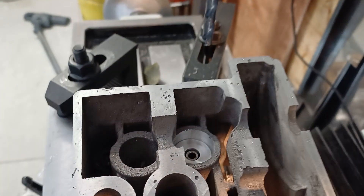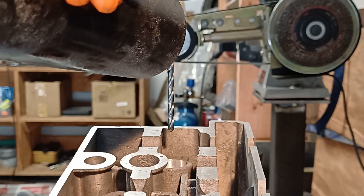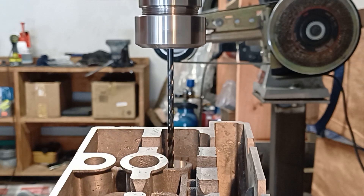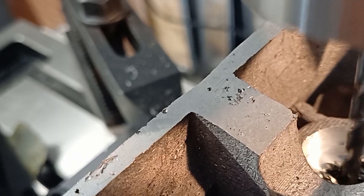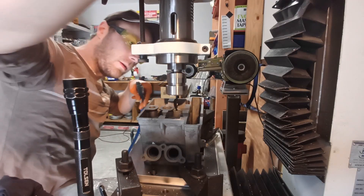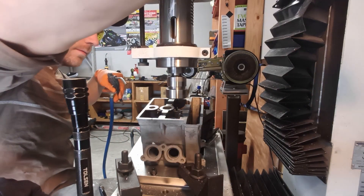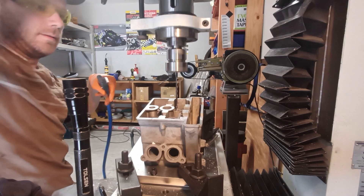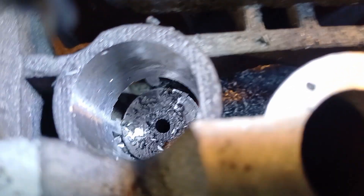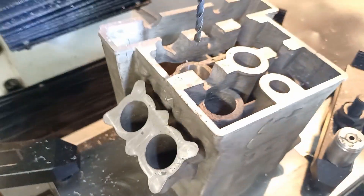Collet chuck with our new long drill bit in position, I'm going to chuck this down here, push that in, and now I'm going to see if I can drill the hole. I have a feeling that might happen. It comes through. I have the guide plug out and it seemed to do its job. We have a hole, nice and centered, going all the way through where we want it. So now to put the bigger drill in.